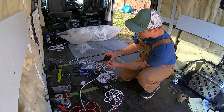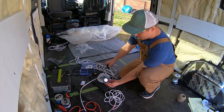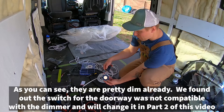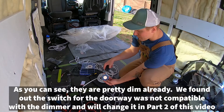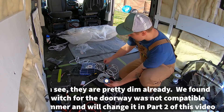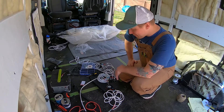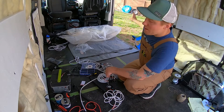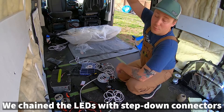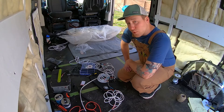When we go to bed or one of us gets up in the morning while the other still wants to sleep, we'll have a light switch at the bed so you can turn the lights on in the living space. I've been wiring up two two-way switches, also with dimmers. I've only wired to the one side so far — this will be the switch at the doorway, and that turns on the light. I also wired that up to the three-way switch for the one at the bed, which has a dimmer. So when we're getting out of bed, you can turn the lights on in the living area, and when leaving for the day, you can turn them off at the door. Wires have to run to the doorway, then over to the bed, then four wires run around to the LED lights on the ceiling, then back to our fuse box completing the circuit.